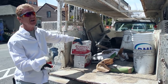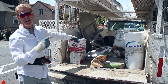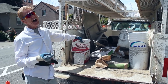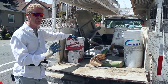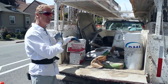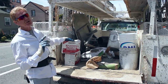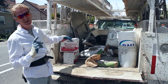The 16-20 grit means I can match this finish with almost any stucco, but we're doing the acrylic finish same day because the owner had half a bucket left and asked me to use it. He doesn't want to wait 30 days — he just wants it done quick. I said you may still have to prime it. All these acrylic finishes, although they say you can blend them in and match the finish years later — they won't match colors, trust me.